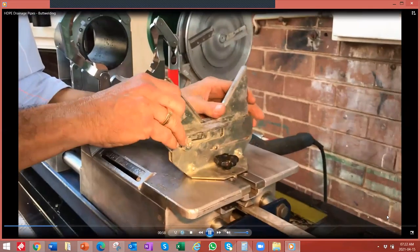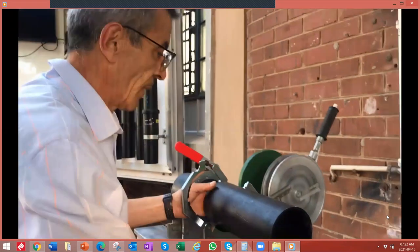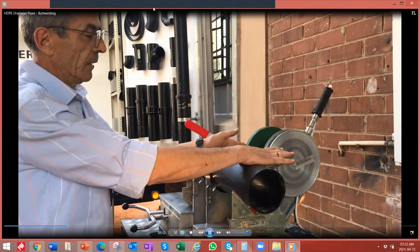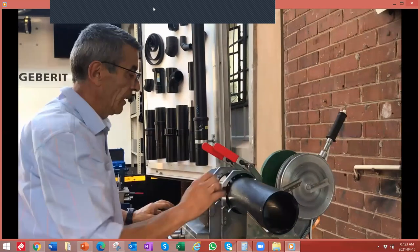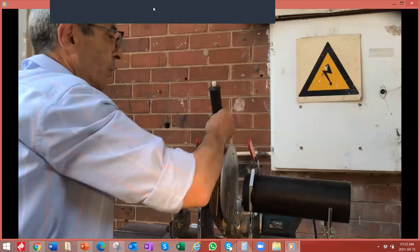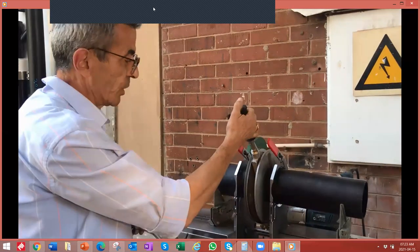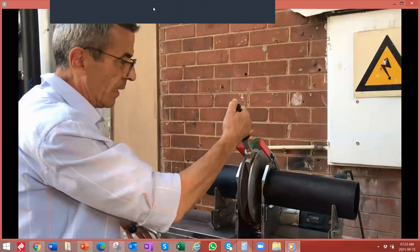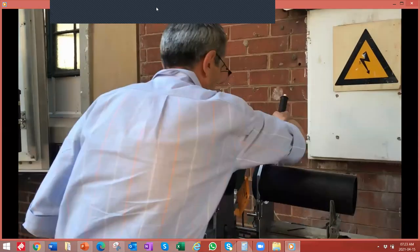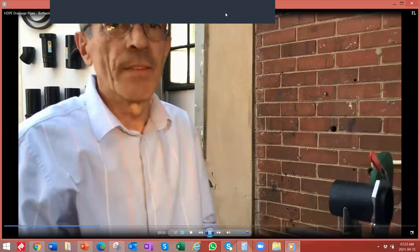The machine has adjustable pipe support for different diameters. The most important is your pipe support — the right-hand part, only used for pipe support. In every HDPE pipe and fitting, as soon as they leave the factory they oxidize. We have to remove the oxidation of the pipe using the planer — we will remove that layer of oxidation. Most guys are cutting the pipe with a hacksaw, which you will never be able to cut 100% straight. Planing is not only removing the oxidation — it also gives you a perfectly flat, square face.